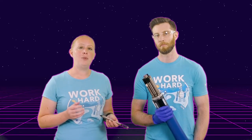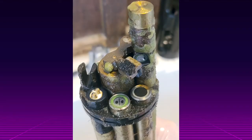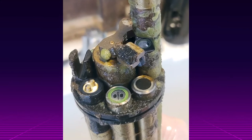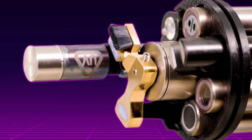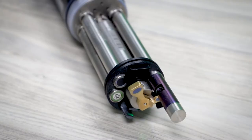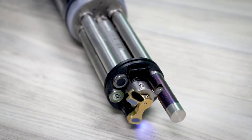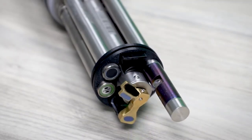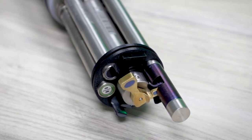For anti-fouling, we have developed a strong wiper brush capable of handling some of the most intense biological and sediment-based fouling. Here's how the NitraLED wiper brush looks when it is fully installed. The dual bristle brush on the NitraLED wiper brush was designed to ensure that both sensor faces of the NitraLED sensor are totally clean during each wipe cycle.